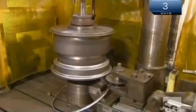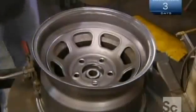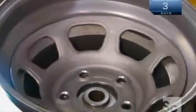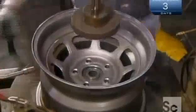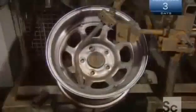They trim the rim to make the edges neater, finishing off the part. They nestle the center disc loosely in the rim, and as the rim spins, they heat the outside with a torch. This causes the steel to expand, and the center disc drops further into the rim. As the rim cools and contracts, it shrinks around the center part. The two parts are now interconnected, and a welding job makes the bond permanent.